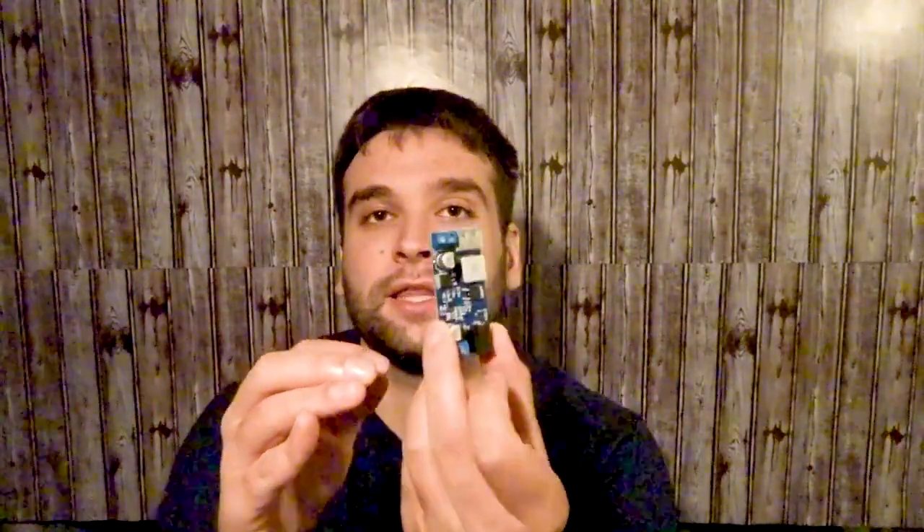It really is a great buck converter when you're not risking damaging all your hard work. It's great for heavy-duty stuff where you have an idea of what the current is going to be but you're not fully sure — so you get a variable current buck converter like this. And once you do know what that current is, get a fixed buck converter like the next one.